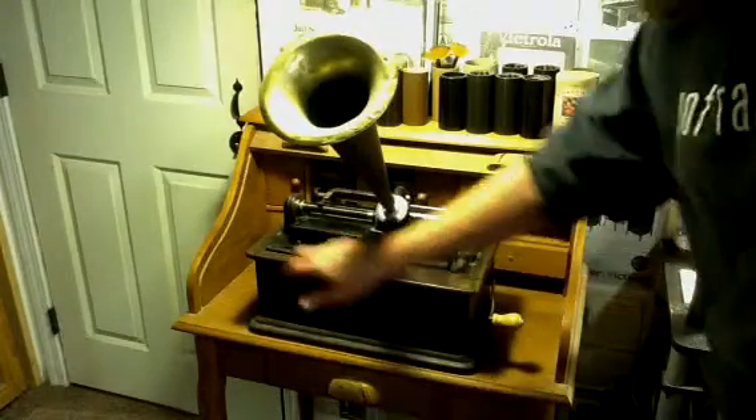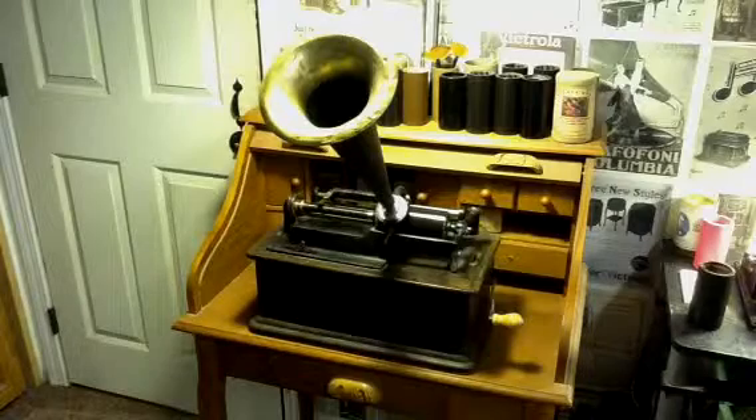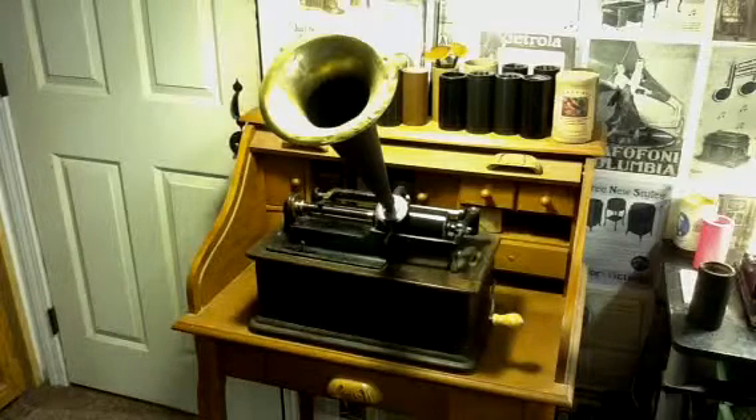That's streaming audio directly from the archive. Now, remember, we're dealing with raw audio here, so your recording is only going to be as good as the audio file you're using. And since this is raw audio, it can still be manipulated dramatically before you make the cylinder recording, because now it's all done electrically. So an amplifier and a graphic equalizer, and you can really make this sound virtually identical to an original cylinder.